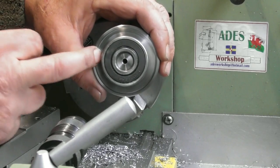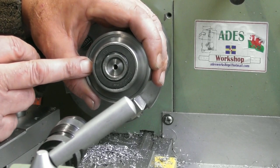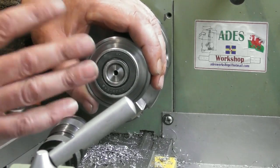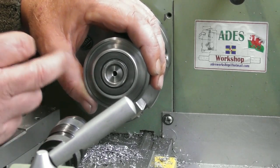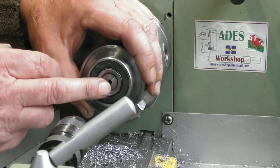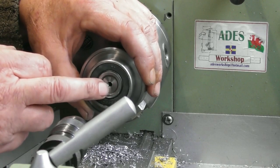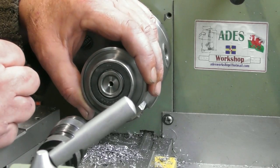The bearing, I don't know if I mentioned it before, is going to be Loctited into the aluminium support. Ideal world, I would have put a circlip in it, holding it down in the groove, but I haven't got any circlips. And yeah, the Loctite I've got, it's the good stuff. It's not going to come out, it's not going to move. Because I haven't got any countersunk screws, I will have to put a little hole in the base plate to relieve the head of the little cap head screw that I'm going to use to clamp it together. But that'll mean that it's accessible from below.